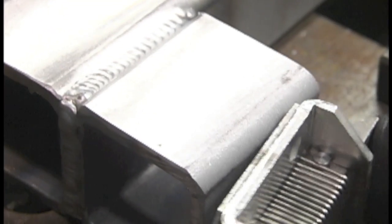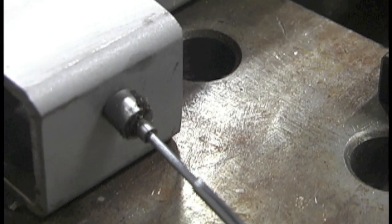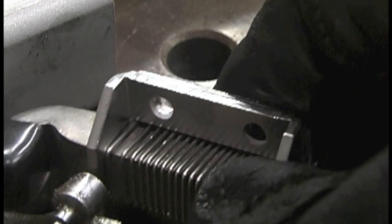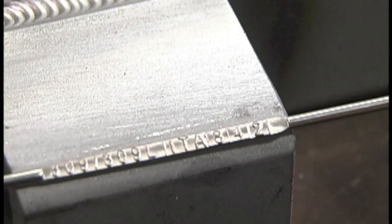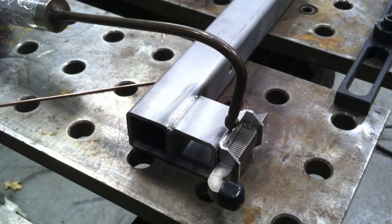Then I've got to put this little spring-loaded latch on here. I noticed it was kind of shiny so I decided to put a magnet on it. The carbon steel is obviously very magnetic but the latch was not, so it's made out of some kind of stainless - probably 300 series, most commonly 304 - which is welded with 308. But because I'm welding 304 to carbon steel, I'm using 309L, which is the recommended filler wire for welding carbon to stainless.